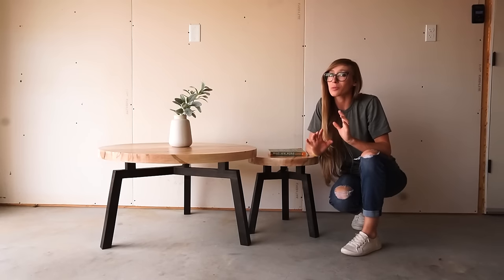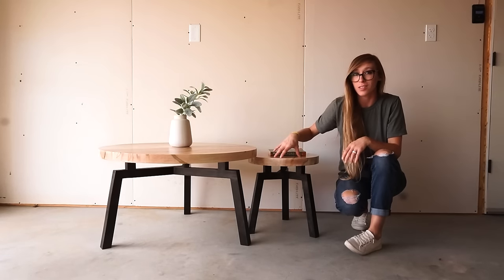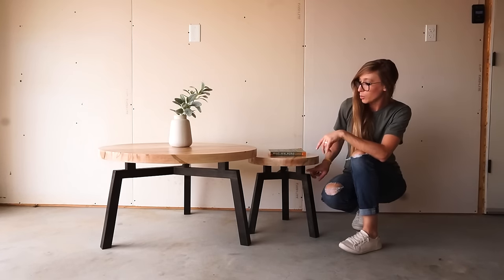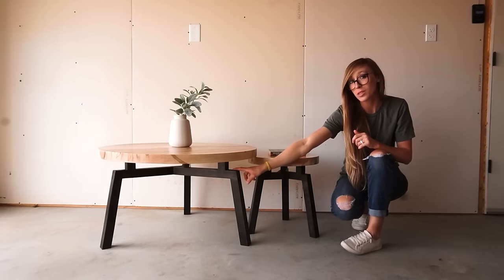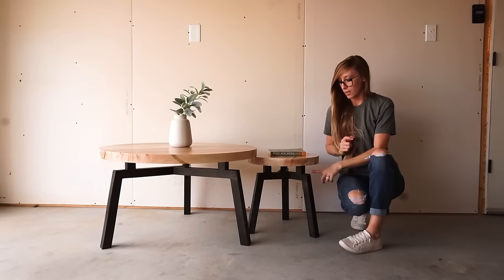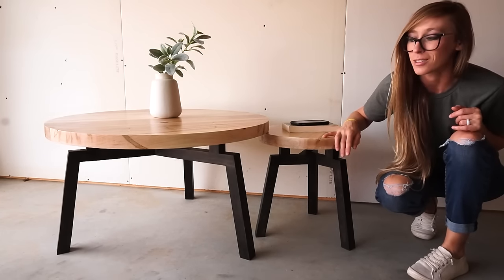These projects were really easy to customize. I made this one 34 and a half inches in diameter and this one was 16 inches in diameter. I adjusted the height, which is as simple as just adjusting the length of the legs. I'll also show you two different ways of assembling the legs — for this coffee table I used half laps on the legs to the support pieces, and on this one I simply used wood glue and screws. Both are plenty sturdy for a coffee table, so either method is fine.